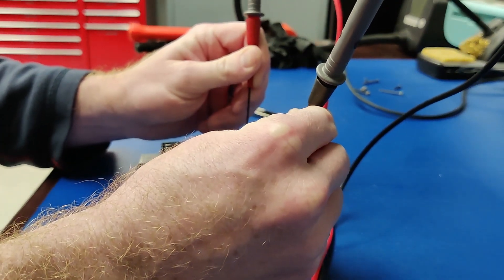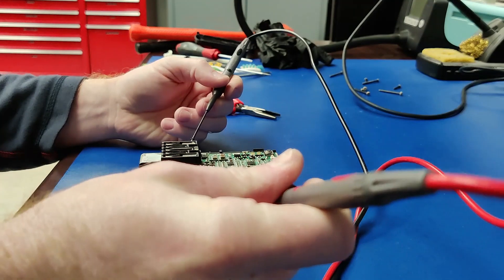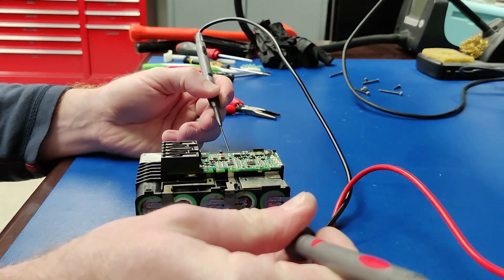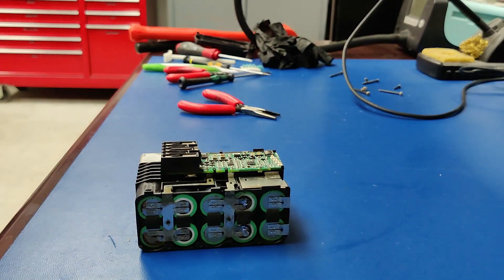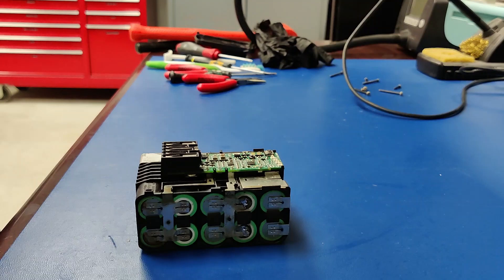The cells I put in there didn't top off all the way — it still shows a full charge but one is sitting at 3.6. It's just taking a surface charge; when you turn it back off it drops to 3.6, so I'm going to have to down-cycle this pack a couple of times to try and clear out any crystallization that's causing it not to want to top off.